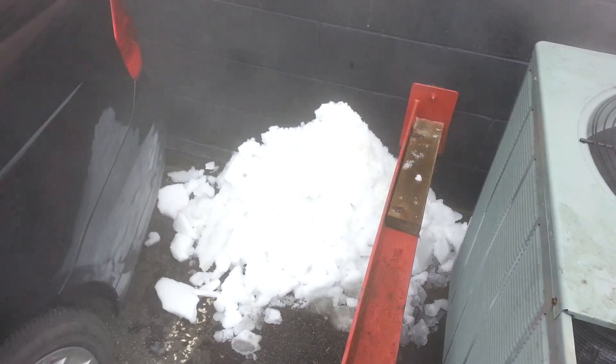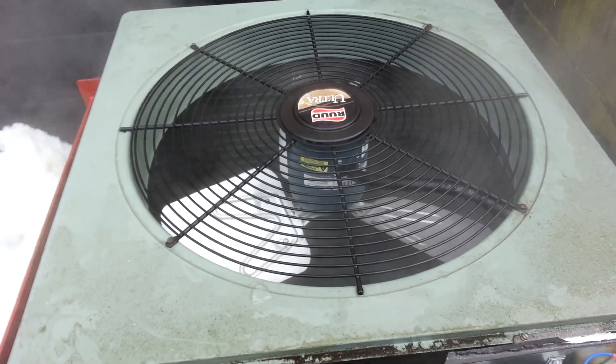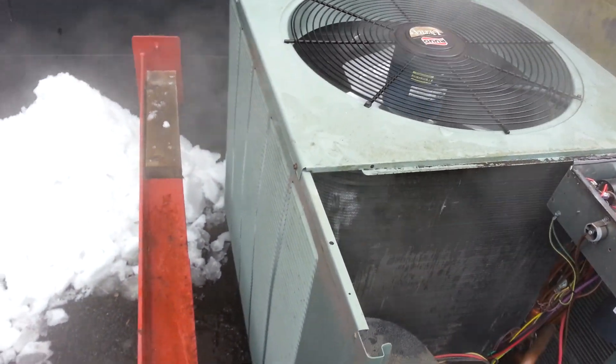As a result, I've pulled this much ice out from the inside of the coil. There's actually so much that it was stopping this fan motor from spinning. At least it's an ECM motor, so it would just trip out instead of burning out.